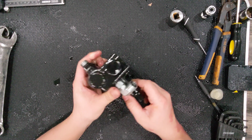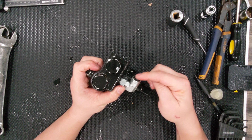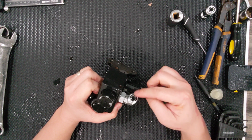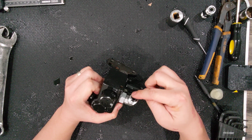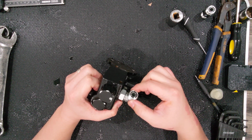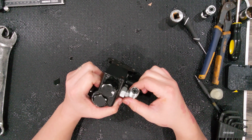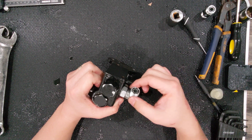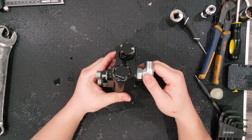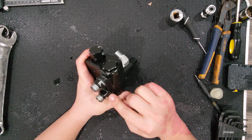All that to say, you have a feed, a 1/2 inch feed that comes directly from the existing pump. For those of you not familiar with hydraulics, this is called an O-ring face seal, or ORFS. They measure these in what they call dash sizes. A dash one would be 1/16 of an inch. So it is standard measurements, and this is a -8. 8/16 is 1/2. On this side, and I'll show it to you in a minute, is an O-ring boss. Same thing in here, you have O-ring boss. These are -6.